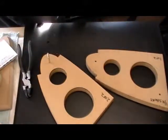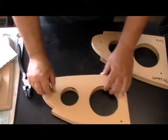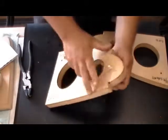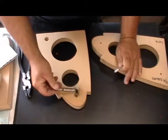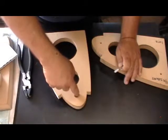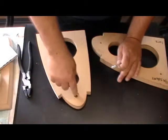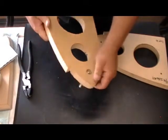A couple of side things to talk about for people who don't know a lot about tools — woodworking guys will know all about this. This pattern moves flat on a router table, so you want it flat and smooth, but you've got a bolt head sticking out. You've got to recess the hole the bolt fits into — a recessed hole. We do that with what's called a Forstner bit. I used a 3/4-inch Forstner bit; it goes in your drill press and makes a perfectly shaped hole with a flush face, not a beveled face like you get from a drill bit. That allows our tooling bolts to sit flush so we can move this thing around on the table.